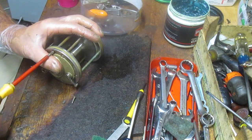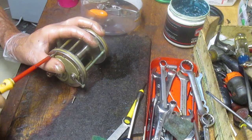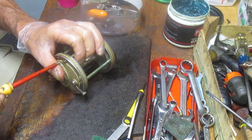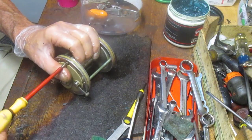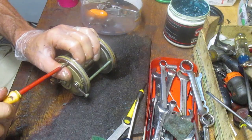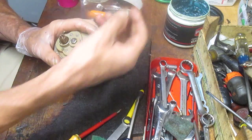And you also learned a trick there. If you have a stuck screw, use WD-40. Use a kitchen scrubby pad, an abrasive pad, to hold it so that you don't mar the chrome. Use a channel lock pliers to turn opposite if the screw is stuck, making sure that you soaked it with some WD-40. Okay, we remember this ferrule.